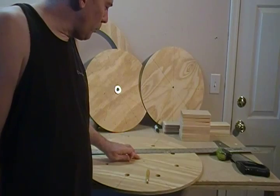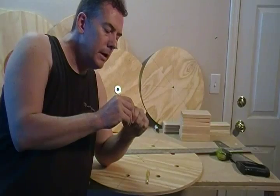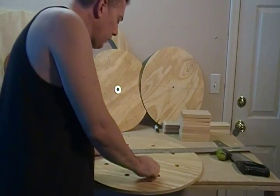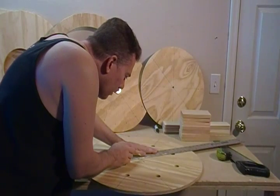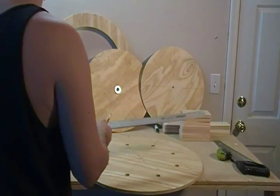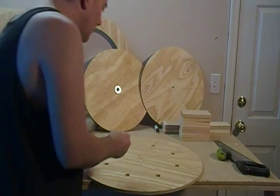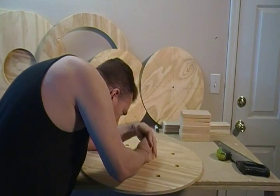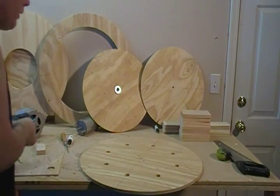You should have already filled in your hole with the wood epoxy. I have a little piece of it here, nice and cured. What we're going to do now is take your straight edge, go ahead and relocate the center, take our center punch, go right back to that right on the epoxy there, and pilot drill it.